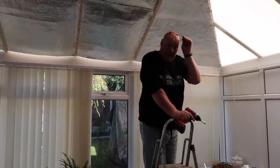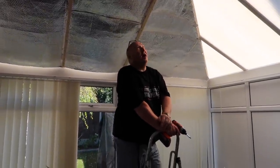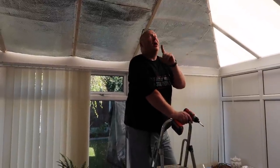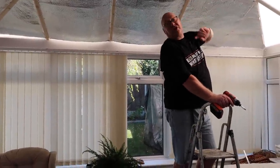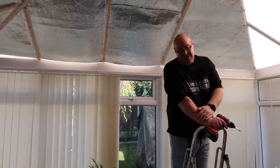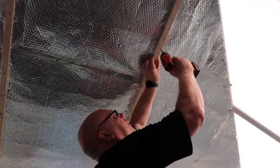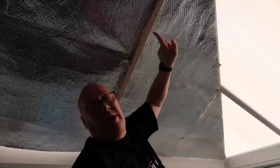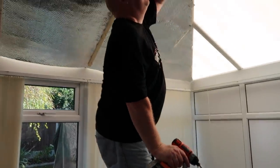This is remarkable - like the issue up there with the screw and the nail, I've actually hit the screw that I already put in on the first lot of battening. So what I've done is drilled two holes just in case - for the sake of ten seconds. I found the bit of screw underneath and moved it to the other hole - just makes life a little bit easier, saves time getting up and down the ladder.